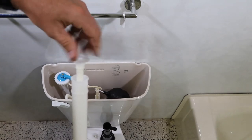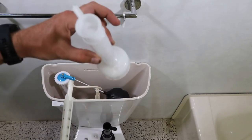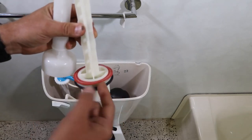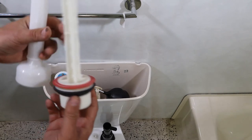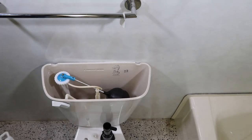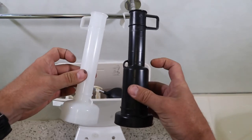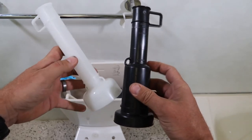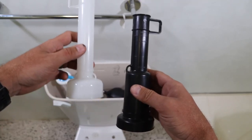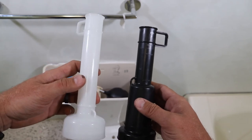Remove the top nut for this one and set it to the side. Remove the top bell like you did before. By the way, it does come with a new washer, so if it leaks it might be worth changing that with the new one. If you compare the two, the difference is this bell comes up higher than the other one. That means the original allows 1.6 gallons, while the new one stays up and floats longer before it drops, allowing more water through.